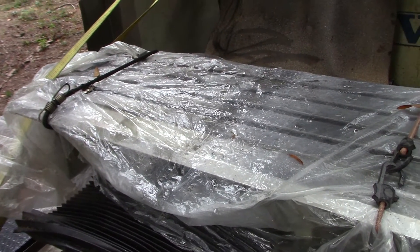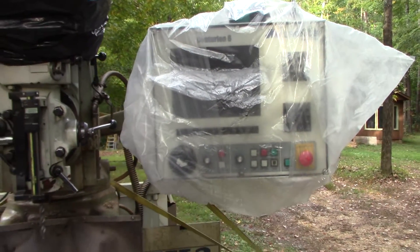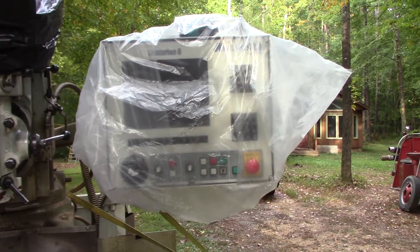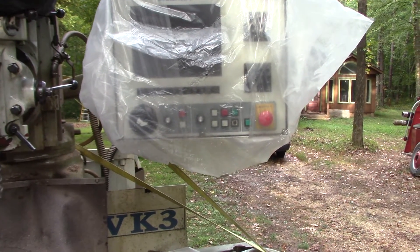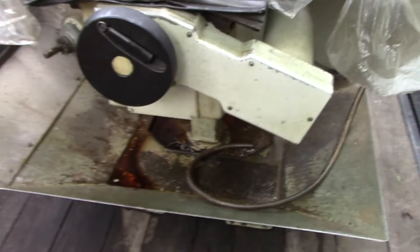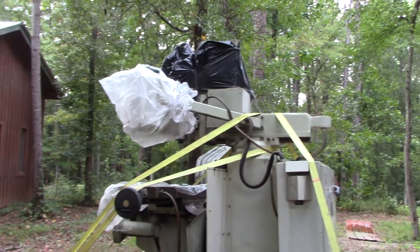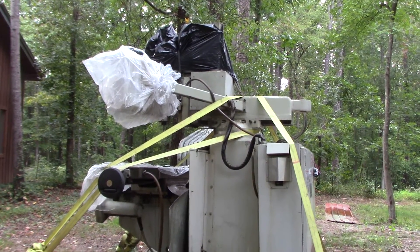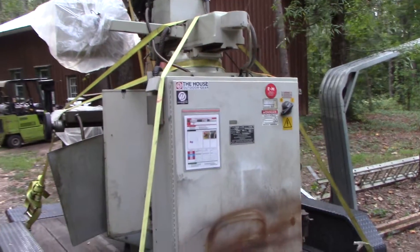The hardened table has a little moisture on it but I'm going to get it in the shop. This thing is really nice - conversational control. The machinist showed me how to set zeroes and do the canned cycles. Got coolant in the base, got a coolant pump. It's a fully functional CNC mill. R8 collets - might wish it was 40 taper but R8 is fine because I've got Bridgeport collets. Probably a 4,000 pound machine.